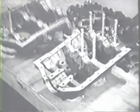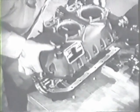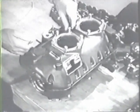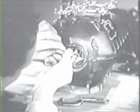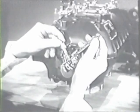You'll remember that you measured the crankshaft bearing surfaces where they fit into the crankcase. Now you want to measure the crank bearings and get clearances. In order to measure the diameter of the bearings, you'll have to put the two halves of the crankcase back together temporarily. To get accurate measurements, bolt the sections together by tightening the nuts on all bearing studs. Now measure the diameter of the bearings. Take your measurements in at least two directions and use the larger one if there's a variation.